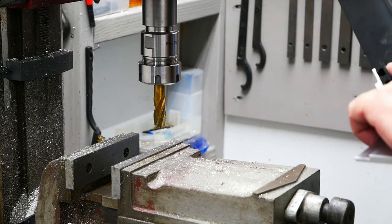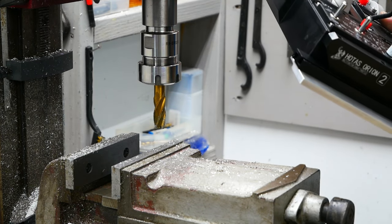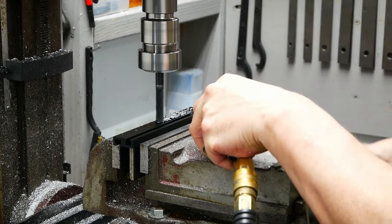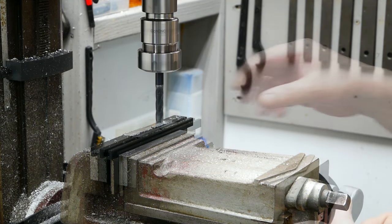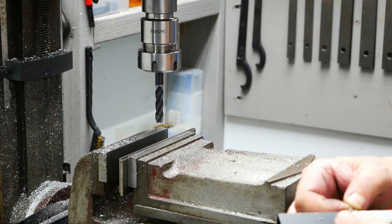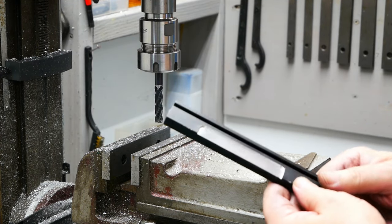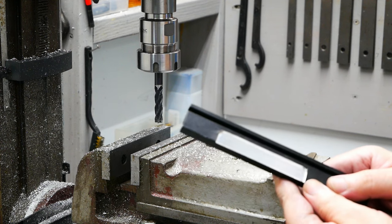So what I may have to do is trim that rail in this section down a little bit to fit under it — and that's what I'm going to do next. I just marked it right here, this is what I have to take off. I'm going to deburr this, sand it down a little bit just in this area. Okay, so I've done that, cleaned the edges up, it's all smooth, and it fits now. That's about 0.3 millimeters in depth which I took off.